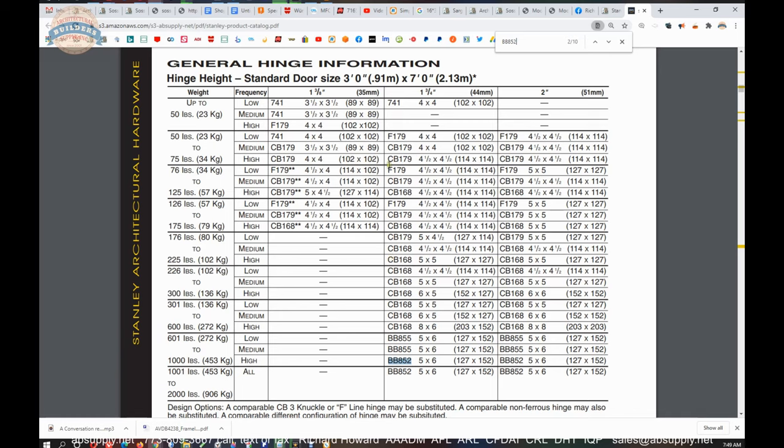So the point of what I'm driving at is, to do even moderately heavy doors, in the 225 pound range, which, you know, I'm thinking 3670, 16 gauge steel stiffened, okay, you're automatically, for sure, at a 5-inch tall, concealed bearing, heavyweight hinge. So you're already at the upper limits of what you're going to see in terms of doors, and you're really only dealing with 225 pounds if it's a high usage door, obviously. Okay. And after that, you don't really see hinges of that kind for builder's hardware.